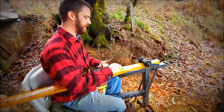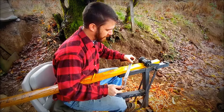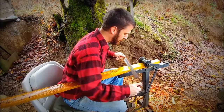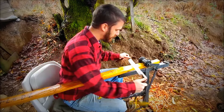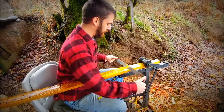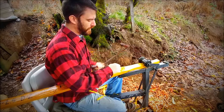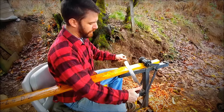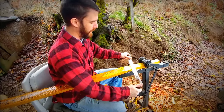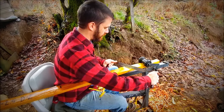You don't want to leave too much for your scraper because scraping is slow work — so get what you can with the draw knife. I'm just leaving this little area around the knot proud with a little bit of the growth ring that I'm tearing away. I'm leaving some of that there around the knot for now and I'll come back and clean that up with a finer tool.